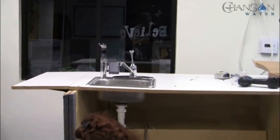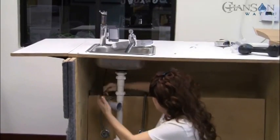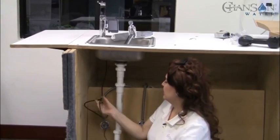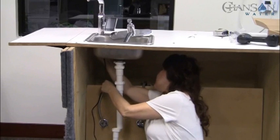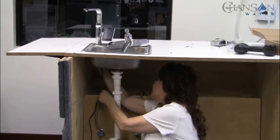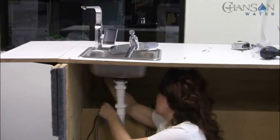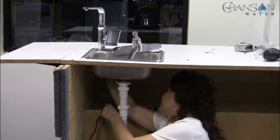When you're working in a kitchen that has a garbage disposal, this is a little awkward but not impossible. You may have to take a little bit of time and rest your arm. Feed the cord through the nut and go up to hand-tighten the nut first. Once it's hand-tightened, thread the installation cup onto the cord and get it up there — that will make it very easy to get the nut tight without needing a special tool.